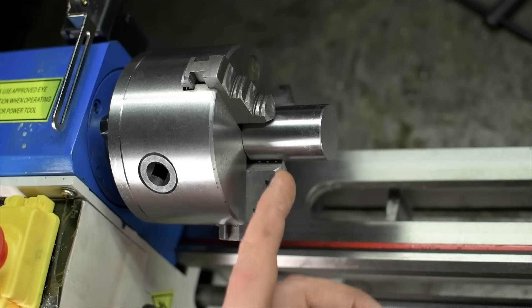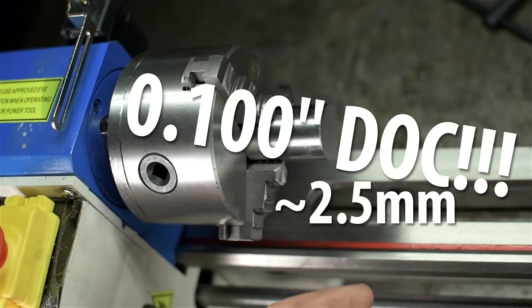I can lock it down nice and square and install the tool post. I machined a step in the riser block just to have something to register the tool post against. Poor planning on my part meant the hole I intended to use is immediately above the counterbore hole for the mounting screw, so I opted for a shoulder or step instead. Let's try it out — that's cold-rolled steel, same as before. Let's see if the bearings can handle a hundred thou depth of cut.